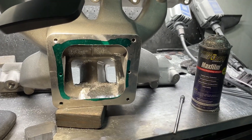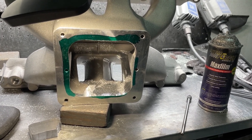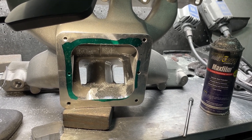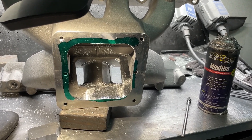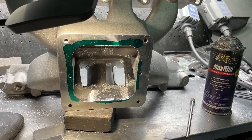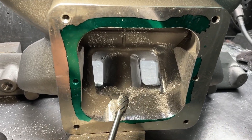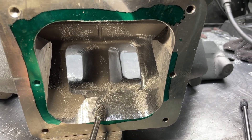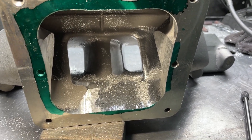This is a CHI manifold — I don't know what aluminum they use, but it's much more dense than others. Some blower manifolds are also extremely dense. I don't know if they hard anodize them, but for those I will use resharpened burrs because they are sharper and will cut through. But if you try using sharpened burrs on a soft cast one, they throw out too much material and dig in — that kind of messes things up.